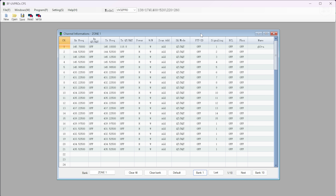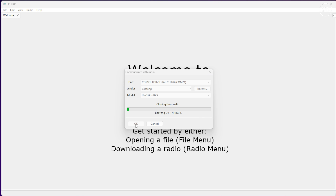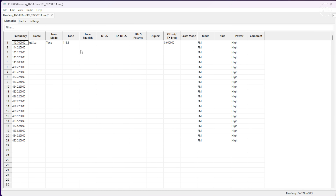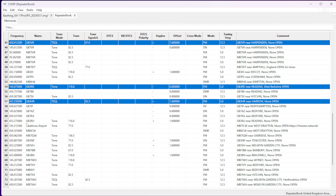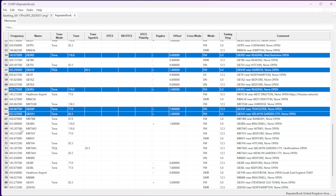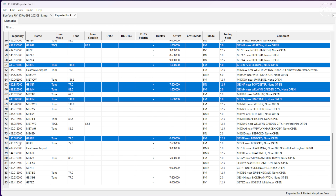Programming the radio can be performed in a few different ways. We saw that we can program memories directly on the radio itself. The next option is to use the official Windows application — for this you will need a programming cable, which wasn't actually included in the box. The official CPS is okay, but there is actually a better way. For those who don't use Windows, you can use the multi-platform programming application called CHIRP. There's currently no official UV32 support, but you can select the UV17 Pro GPS model from the dropdown list, and this appears to work well for both reading and writing memories and settings.